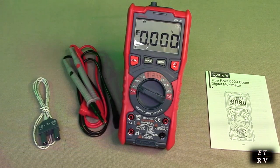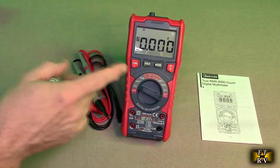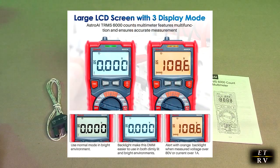You can measure your diodes and frequency — we're going to test some of those things out. It's really handy to have something like this in your house if you're ever testing your electrical system, your car, or your 12-volt DC. The multimeter has passed overvoltage category 3, 600 volts, and CE safety standard. It has anti-burn double ceramic fuse and thermistor protection circuit inside — fuses can be replaced if you ever exceed the current limits. It also has a backlit display and a flashlight included.